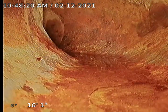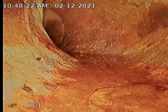Hi, this is Brian with Mr. Reuter Plumbing doing a sewer scope at 137 17th Avenue in Camas. Point of access is a four inch cast iron roof vent. We're going to check the serviceability of the sewer line and the point of access out to the city main. We are in the horizontal position right here, so there's zero footage on the meter out. We're going to proceed out.